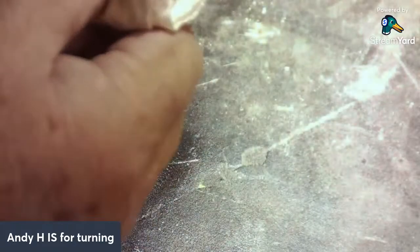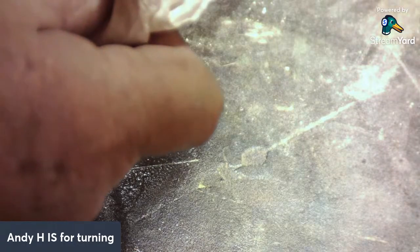On something that small, I would probably have just gone on straight with wax, beeswax or something like that, straight on the lathe before I parted it off. Yeah, it's going to be handled a lot, though. That's the problem. Beeswax does melt a bit with the heat from your fingers. Carnauba's one, which I should probably do on this anyway, you buff it on. Yeah, buff it on. But it looks better for some sanding sealer on.